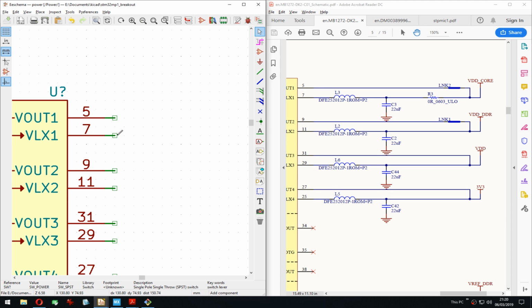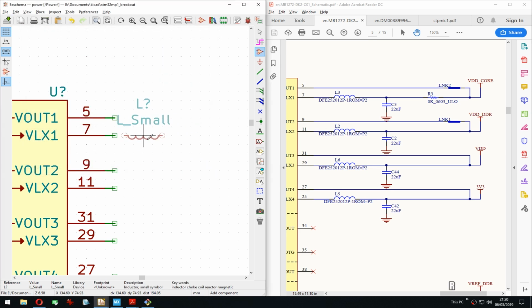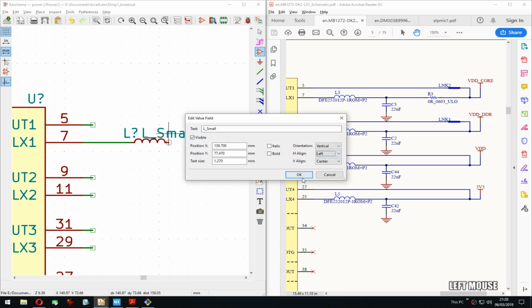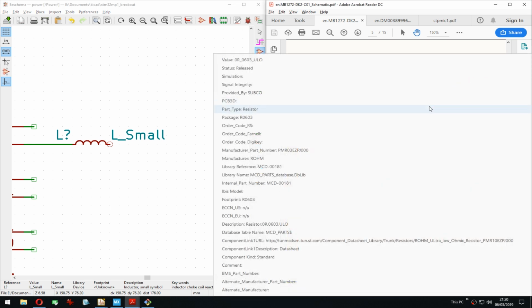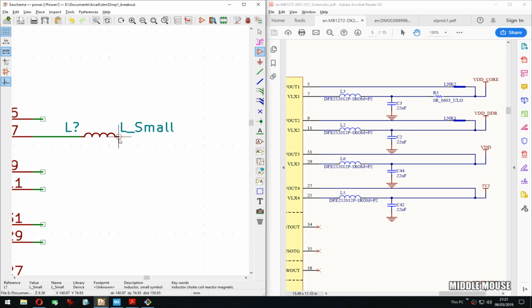So we have a small inductor right here. It's a very small inductor. Then we have the 0 ohm resistor for no reason, so let's just skip that. This is probably, I would assume, for measuring current consumption, so you can remove that and put a multimeter there to measure the consumption. Maybe this is also what the link one is for, but then never mind.